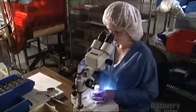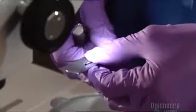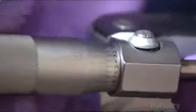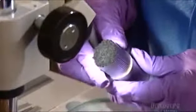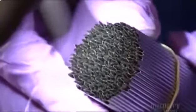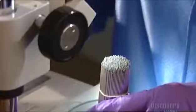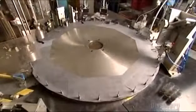Now it's time for the big inspection. She pushes the ends of the needles with the back of her tweezers to make sure they're even, then pulls out a needle for sampling. She measures the length of the grind — it should be a few millimeters long. Next, she sizes up the needle's outside diameter with a micrometer. Then she checks the inside diameter by inserting a plug gauge into the tube. Now she inspects a whole bundle of needles for irregularities or burrs, using tweezers to remove one for a close-up look under the microscope.